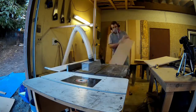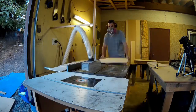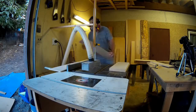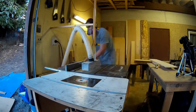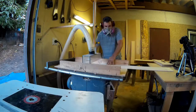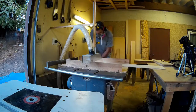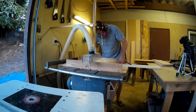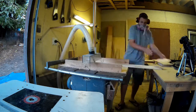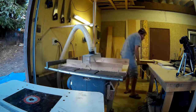For this build I'm going to use what I call sandwich box construction. You don't have to worry about MDF seams — to me this is the easiest way to build a box. You basically build the sides, top, bottom, and all the bracing all at once, and then sandwich it together with the back and baffle. Here I am making rip cuts and cross cuts to get all the pieces I need.